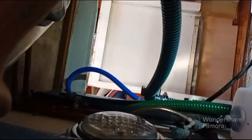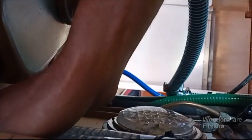One other thing. You see here? There is a little pipe here. It's to let air in when you stop the engine, to these hoses. Anti-siphon. But this is a valve, and when the engine is on, there is nothing, but you will see a little air go. So I put a little plastic one here.